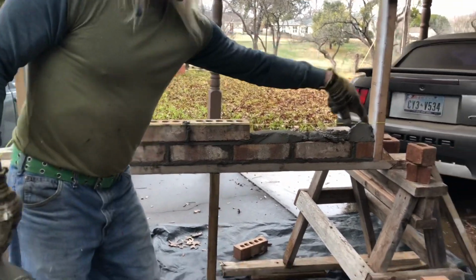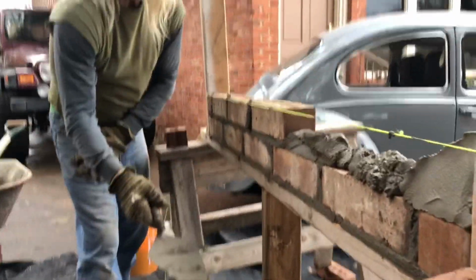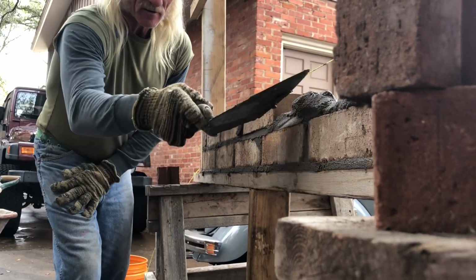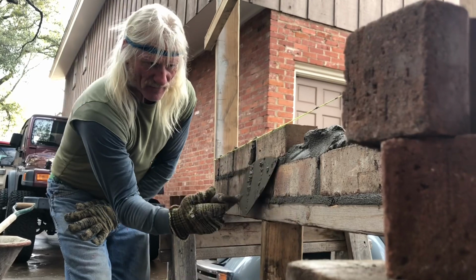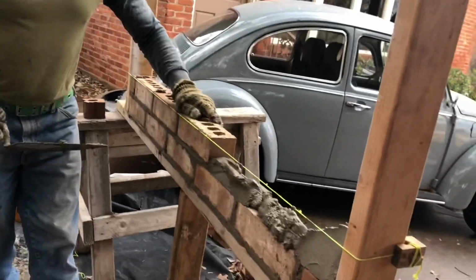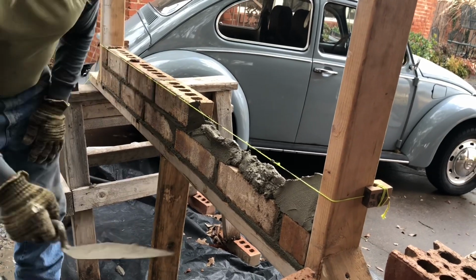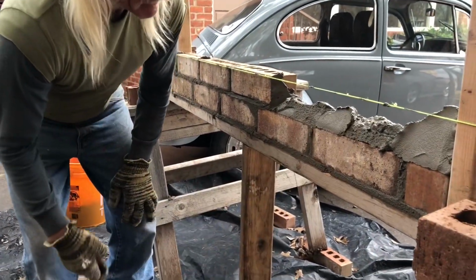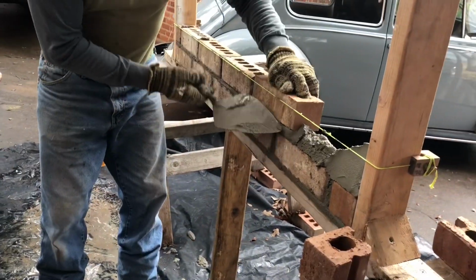Hey, can you go on this side with the camera? Maybe they can see. Say you got a little bit of mud there. Maybe down here and point up and see what it does on the back of my trowel. Watch this. And if your camera goes in slow motion, I'd encourage you to do that, and that way you can see exactly. See here? You see that? There it is. That way you have it on right where you want it on your trowel to put it where you want it on the wall. Like I said, put your cameras in slow motion if you need to. Those are real handy moves right there. And here, see that's hanging out there? I'm gonna get it. Got some suction again, and you can cover that up. That way you won't have to go reaching back on your mud board again or anything. There we go.